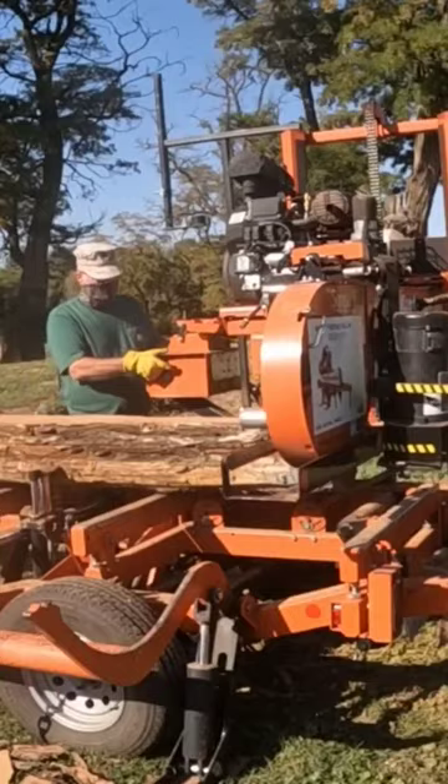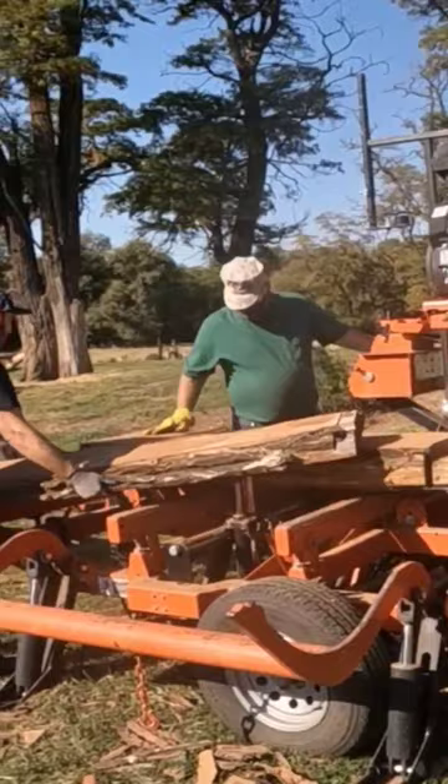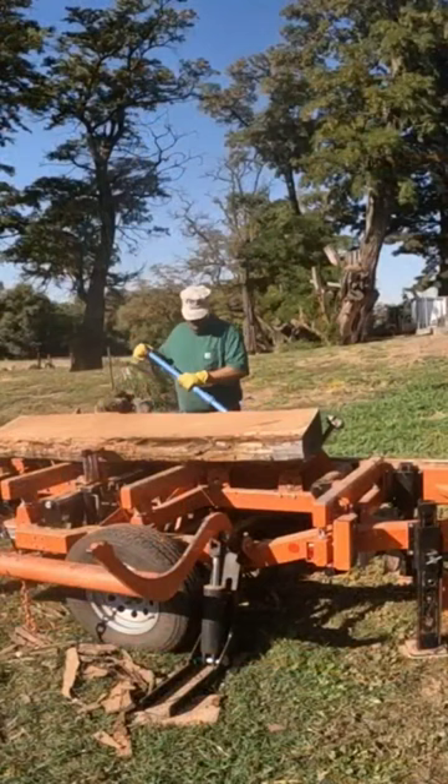Last time I checked, they're about a hundred bucks a band. Those bands are made for re-sawing dry beams. You don't want to run into dirt, rocks, or even dirty bark — those will dull them fast. And certainly don't run into nails with them; you'll destroy them and then you're done.